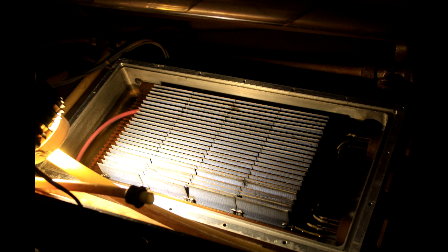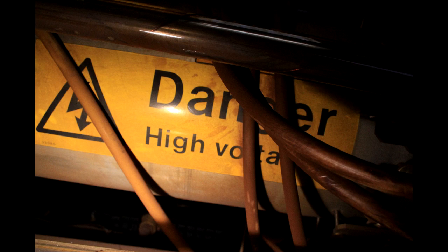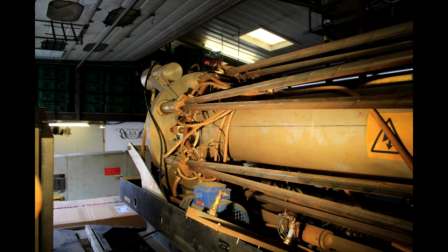There are also ballast resistors that the fluorinert coolant runs through, which dissipate a huge amount of power. These sit in sealed diecast boxes and the whole thing is sitting at 28,000 volts, so it's not something you want to be playing with. When doing alignments you have to be quite careful — you need to get in there and adjust mirrors while being careful not to stick your finger in the 28kV areas.